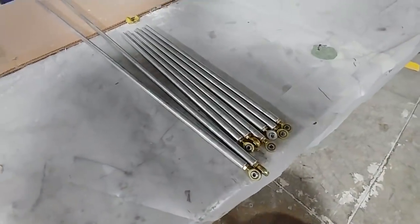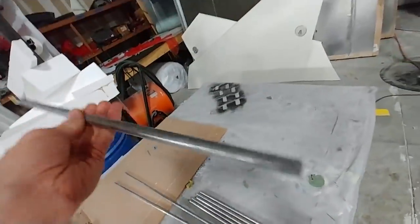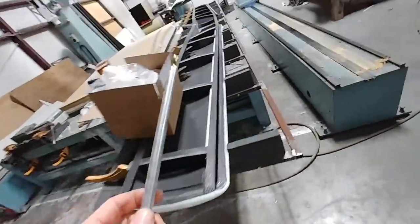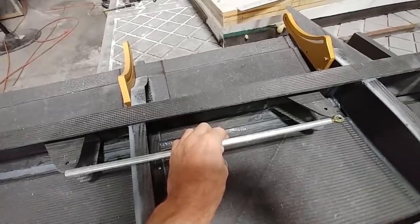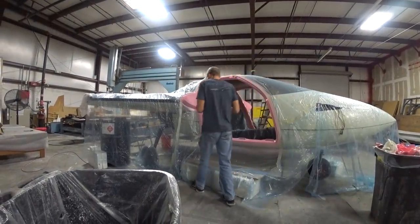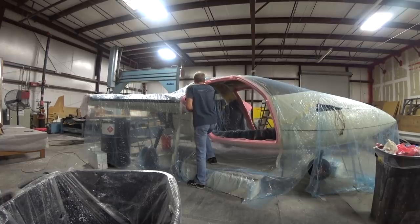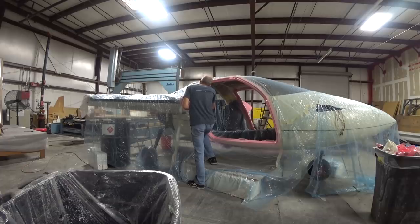There's the finished product — at least half finished. I still need to tap the other ends with the left-hand tap and put the hardware in; you can see they're drilled but not yet tapped. These will all sit in between each of the different actuators for the elevator. After getting quite a lot done on the push rods, I decided it was time to man up and start sanding, filling some of the pinholes on the front areas for the fuel tanks, which were raw carbon and really needed fill — same on the other side.